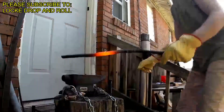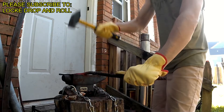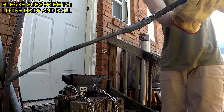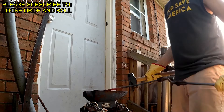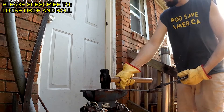Making sure I keep it straight and aligned. Keep an eye on your steel always — don't ever leave your forge unattended. We've got good color on this one. Eventually you can get good at eyeballing the color of the steel so it'll be good enough to heat and move. Remember also that the anvil will act in a way of convection and will pull heat out of the steel really quickly. After a while of forging you'll see I've got a decent shape and I'm starting to shape in the tip of the blade — you do that by raising the hand that you're holding the steel with and hammering at the angle that you would like your tip to start coming in.